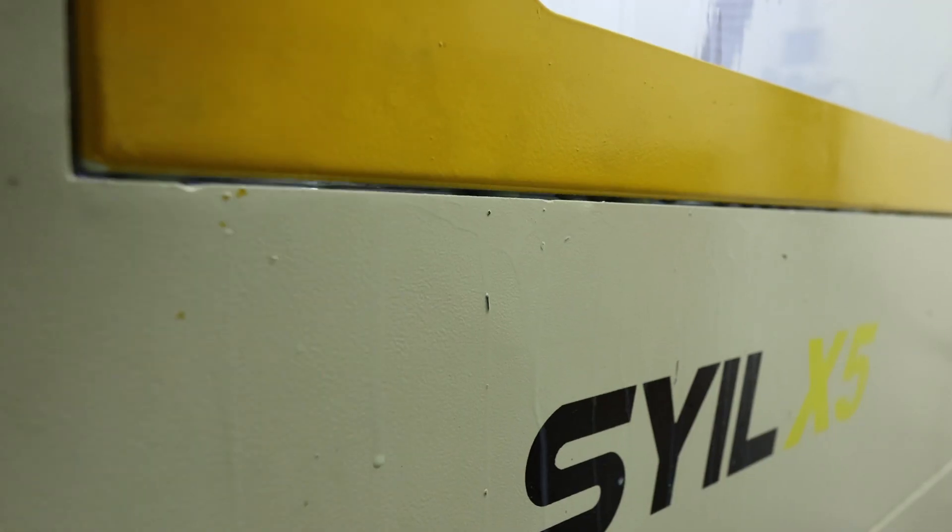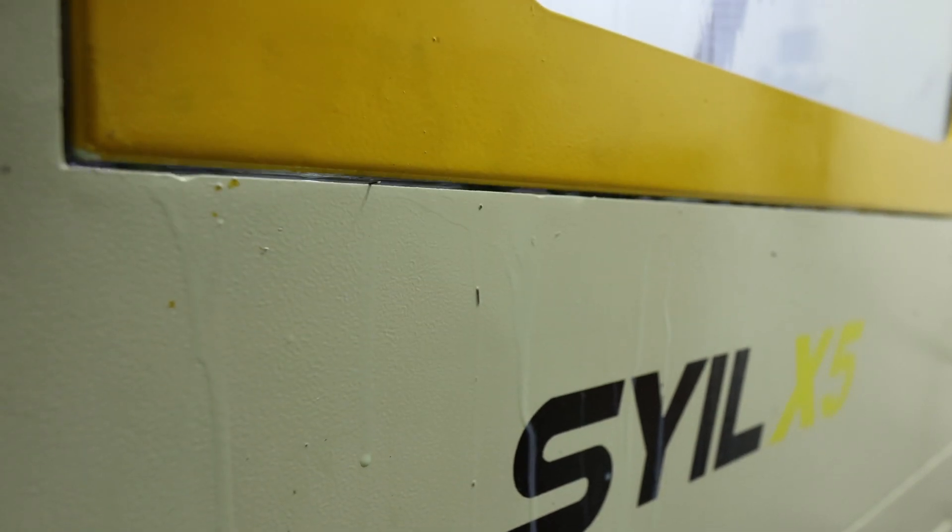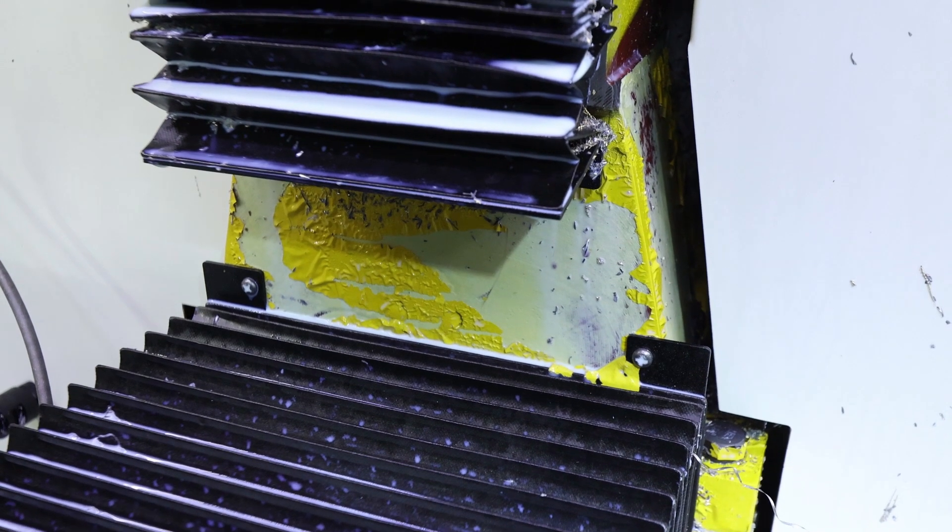The cons, or at least the issues I've had, is that the bed is flat, so the coolant doesn't drain — all the chips stay there and it's super hard to clean. Also, the windows and some parts are not a super tight fit, so it has leaks. And finally, the paint started to peel really, really early. Something to keep in mind is that if something breaks, you will have to fix it yourself. The only issue I had like this was an endstop that failed, and they actually provided me with video tutorials explaining how to fix my specific issue — so I'm happy with their service.